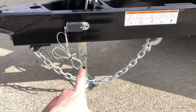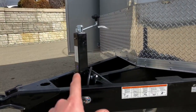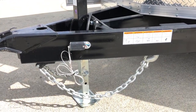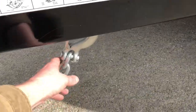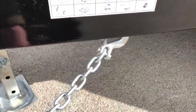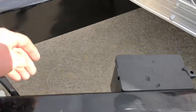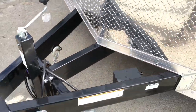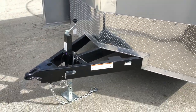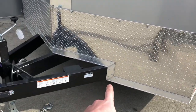It's also got a heavy-duty leg, so you'd pull a pin, the inner leg drops out, and then you have the adjustment with the top wide handle. It makes it so you would pretty much never need to carry around a wood block to get it off. Short Track also does a heavier-duty safety chain. It's got a nice heavy-duty hook on it, where most in the industry just use a light-duty S-hook. That's a meat hook — an equipment-style safety chain. Little detail, but there are a lot of those little details on this trailer.